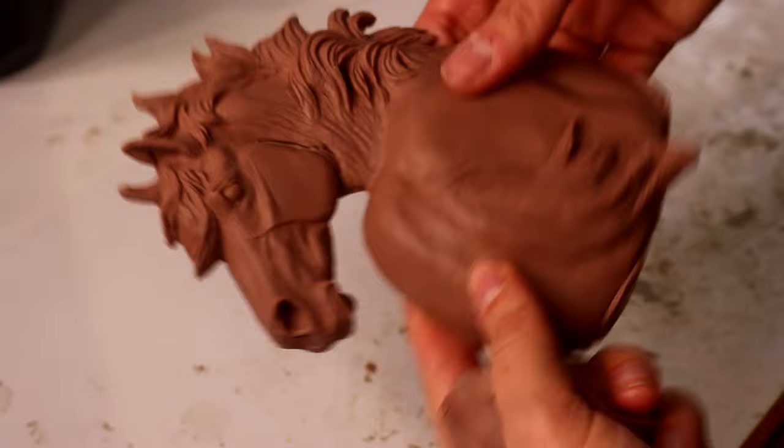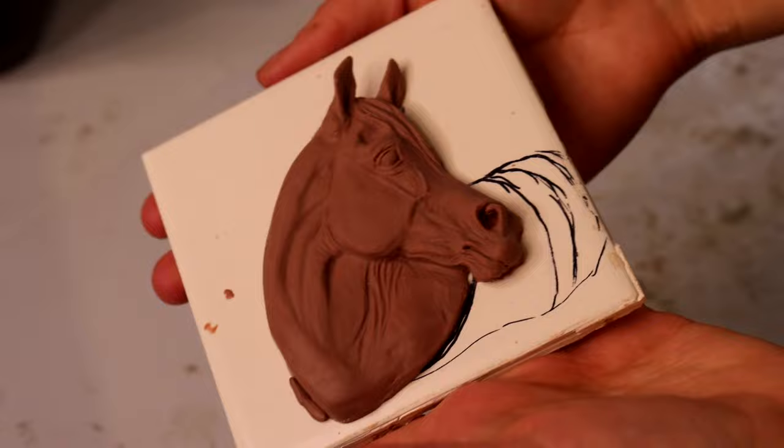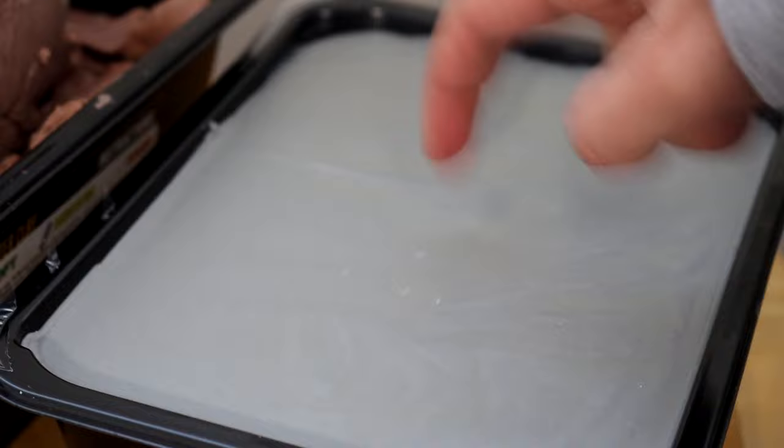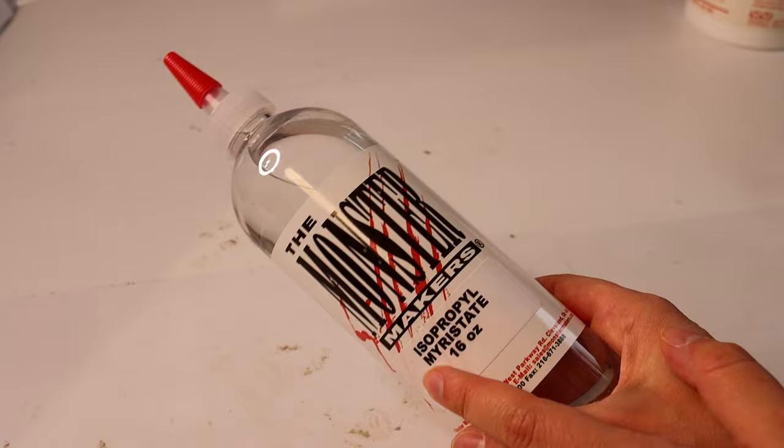That's a little risky, especially if you're new to mold making, and that's personally why I stick to epoxy originals — I can just send the original in the mail without damage, and not put three years of work into a monster clay sculpture only to have it ruined in the mold making process. You can imprint your nail into it fairly easily though, as you can see, so it's not completely solid.